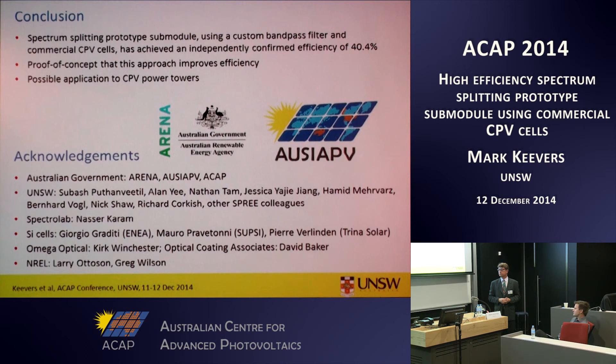Also, the calculation shows the silicon cell is actually converting 43.1% of the energy falling on it — so it's doing quite a good job, probably better than the other cells in the stack. It looks quite bad when it's just 4% from a 26% cell, but it's 43% effective conversion.